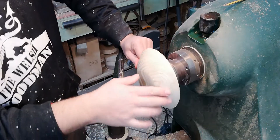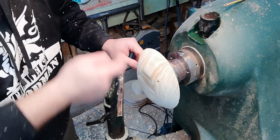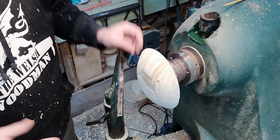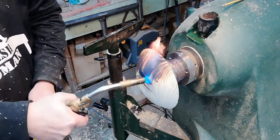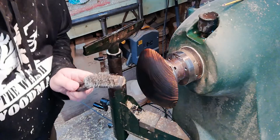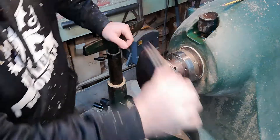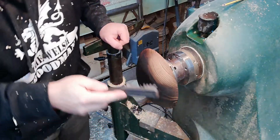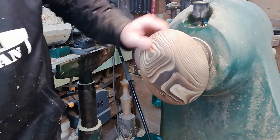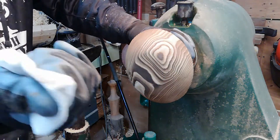There's a nice little grain pattern on this, and to accentuate it I'm going to use my favourite technique: using a blowtorch to scorch it, then wire brush it back. We may even put a wood dye over the top. We've got a fairly smooth wire brush and we're going to be brushing backwards and forwards in the direction of the grain, which gives us a lovely textured pattern.